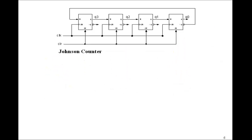Let's see what happens with the Johnson counter. We start out with 0, 0, 0, 0, but not Q0 is a 1, so on the next rising edge of the clock the 1 will go into Q3 and the others get moved over. On the next rising edge Q0 is still 0, so we still have a 1 at D, and we'll get two 1s moved in. On the next clock we'll have 1, 1, 1 as they shift over, and then 1, 1, 1, 1.